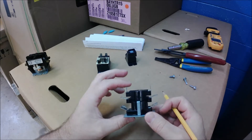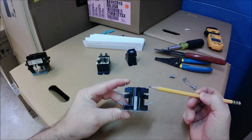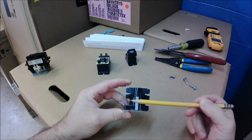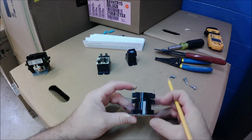It's got two switches. The top switch brings on the first heat strip. If you have to, you can wire it through the second switch — top switch then your second switch. Down at the bottom are your 24-volt connections, that's 24 volts AC.